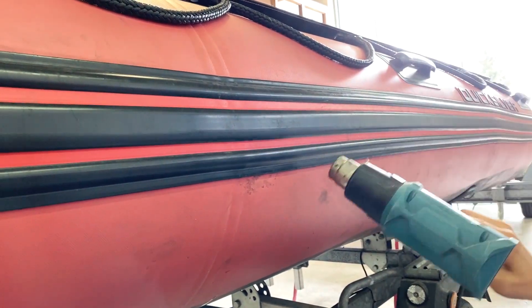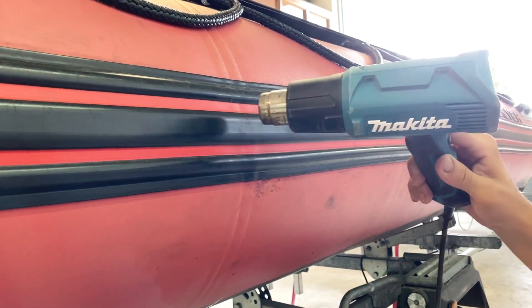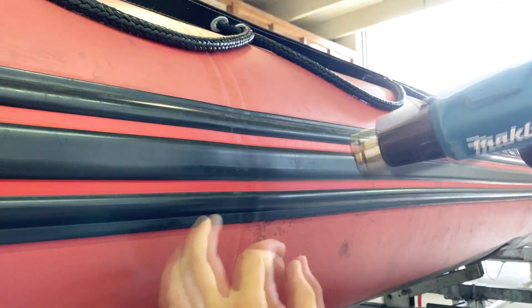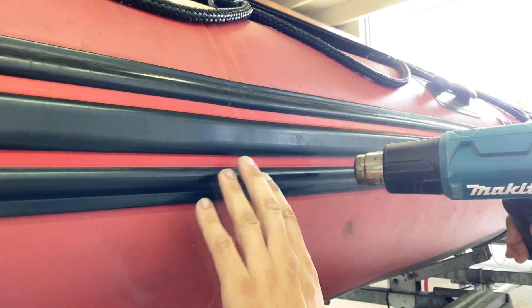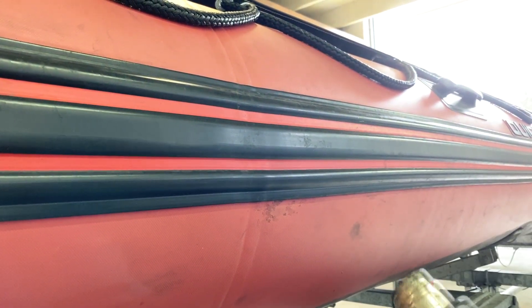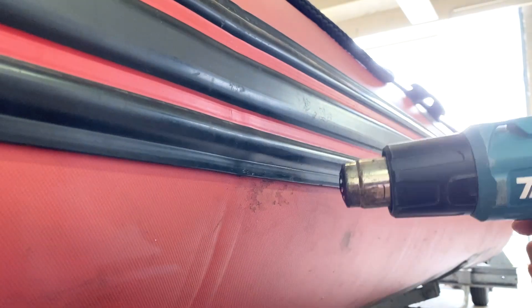We heat the bottazzo at maximum power, then manage the distance or angle by hand. I'll try to lift it enough because the patch needs to be at least 12cm. Avoid those tiny stamp-like patches you see on boats — they look bad and aren't reliable. The patch must be much larger. Also consider aesthetics: a nice patch is fine for resale, but having lots of ugly little stamps really hurts the value.